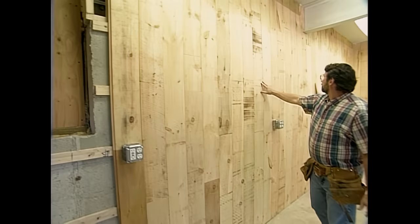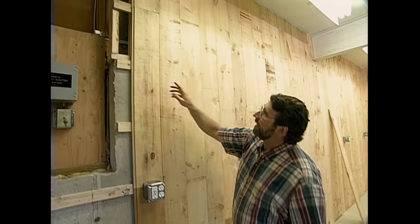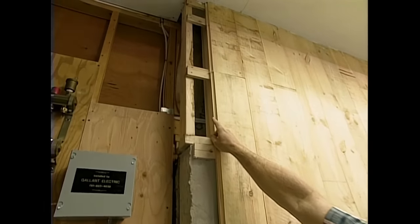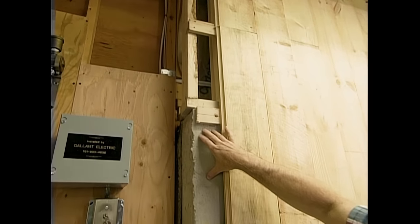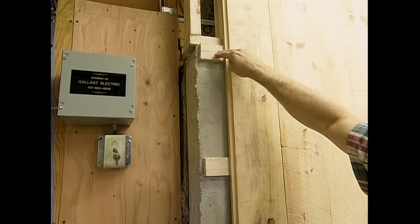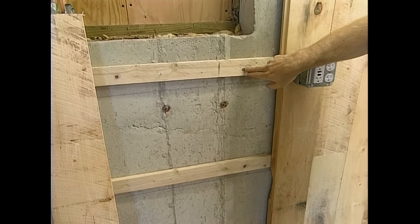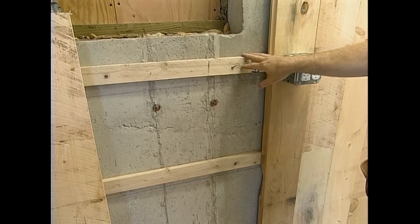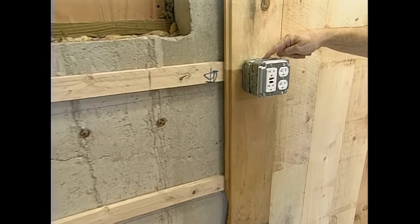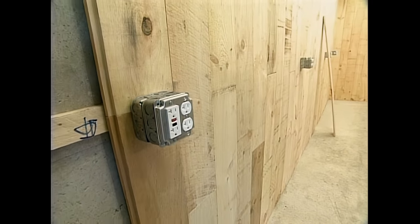The walls are all closed in, and before the wall was closed in, I added insulation wherever it was necessary. Here, we had a concrete wall to deal with, so I had to build a stud wall, then strap everything horizontally, attaching it to the concrete with masonry nails. Then I called in our electrician, Alan Gallant. He rough-wired for outlets — we need plenty of outlets, about every six feet — and also provided some wiring for additional lighting. You can never have too much light in a workshop.